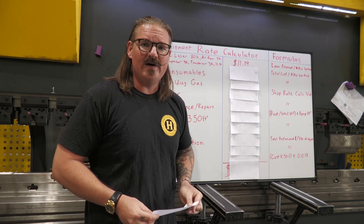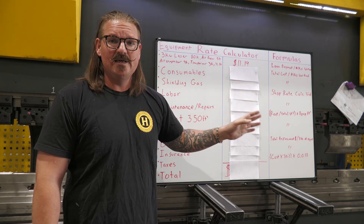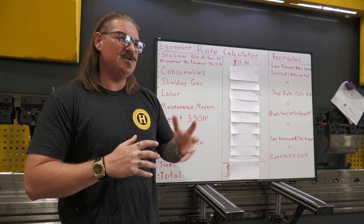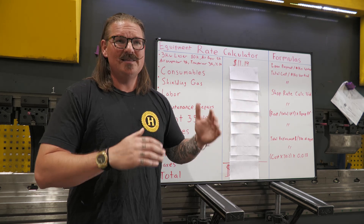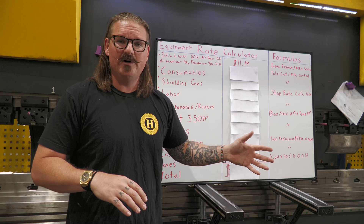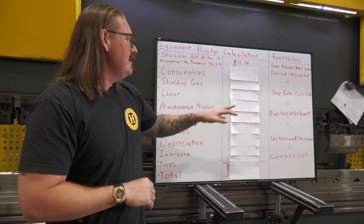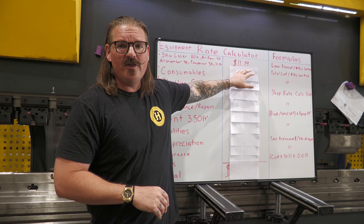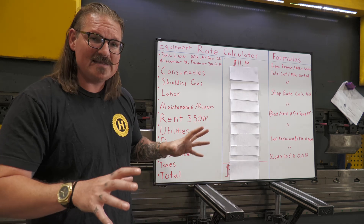Grand total, you're looking at $100,000 worth of equipment to get laser cutting. We're breaking that down into a monthly loan payment divided by the number of hours worked. We run our laser full time — 40 hours a week, sometimes 60. If you have partial utilization, divide that monthly payment by the actual hours the machine is running. Or you can future-proof yourself and bid as if it's running full time, because the cheaper your price is, the more often you'll have that machine booked. Running full time, that works out to $11.14 per hour going to your laser and equipment payments.